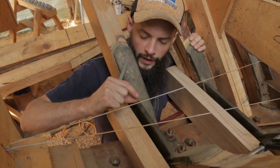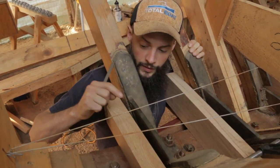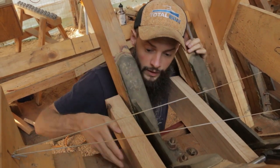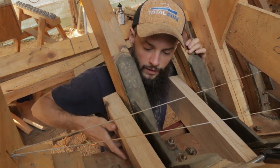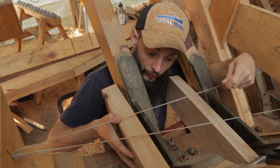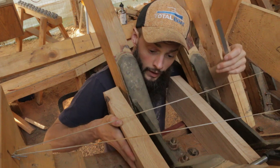So you can see up forward, there's not really much room between where the top of our vertical plate on the bronze floors is and where the top of our sole beams need to be. So what we decided to do is just mill up a bit taller stock. And that way, that can get fit up to the string. We can cut the angle and everything. And we'll just bolt it right through the vertical plate on the bronze floor into it.